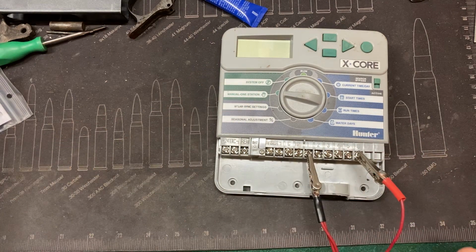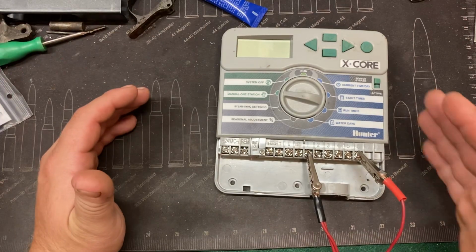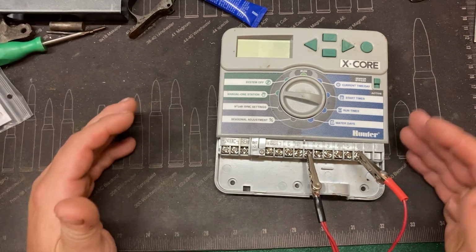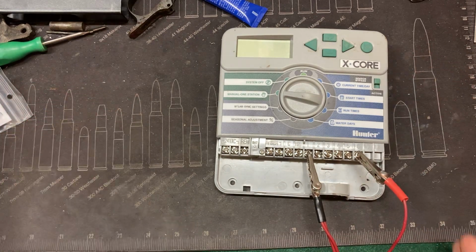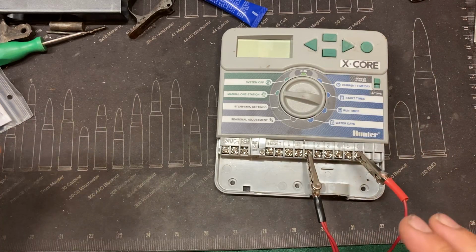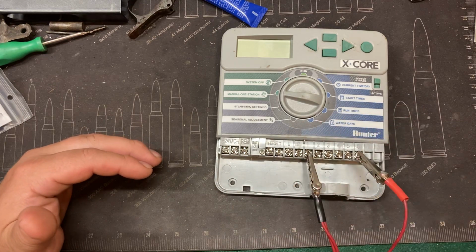And if your installers are thinking about this ahead of time, even commercial zones, I like it because a lot of the commercials that I've installed that I do blowouts on, I got it set up that the first and the last zone are both ends of the main line. So I'm doing what's called dumping the main line. I just run the power, wait for the main line to be empty on those 2 zones, and then it's significantly less time going through each zone.